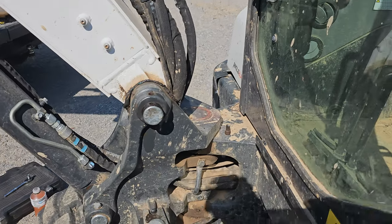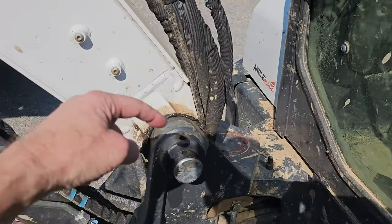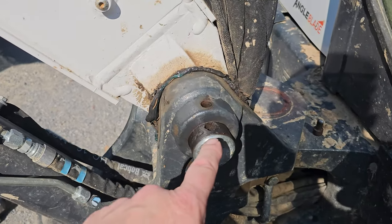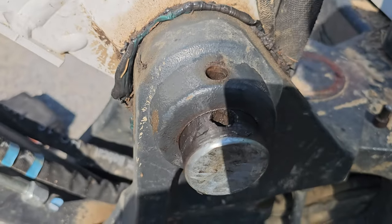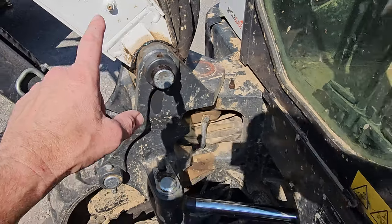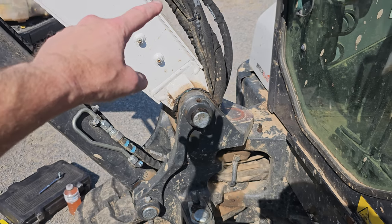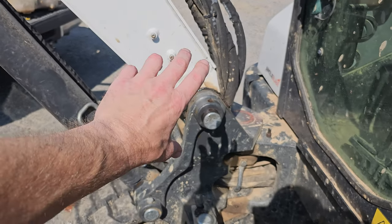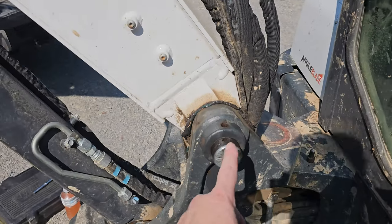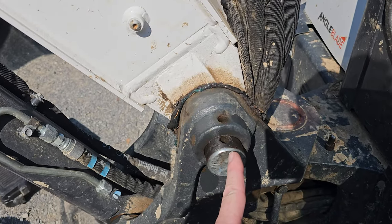I tried a rebar and bolts in there and tried to turn that pin — it ain't turning. So I threw some more grease on it and was able to get it lined up. By manipulating the boom going up real slow and then dropping it real fast, it would move that pin a little bit at a time. It's lined up now — I just have to sledge it in and I'll be good to go.